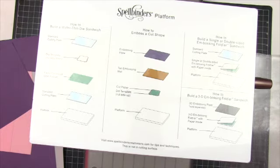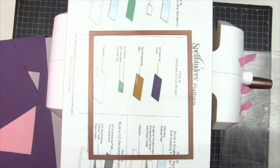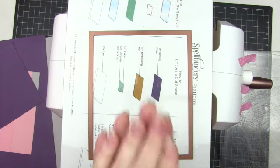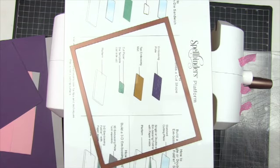So that is really the key, to angle that die. That will make all the difference. So I know that the two issues that were raised were that it was very tough for some of the dies to go through, and that there was bowing on those plates. I hope you can see that it is two problems but with one solution. That one solution solves both things, because it is the same thing causing those problems. The toughness of it going through and the bowing of the plate is caused by too much pressure, and therefore by releasing that pressure, by just turning the die slightly, you're solving both of those problems.